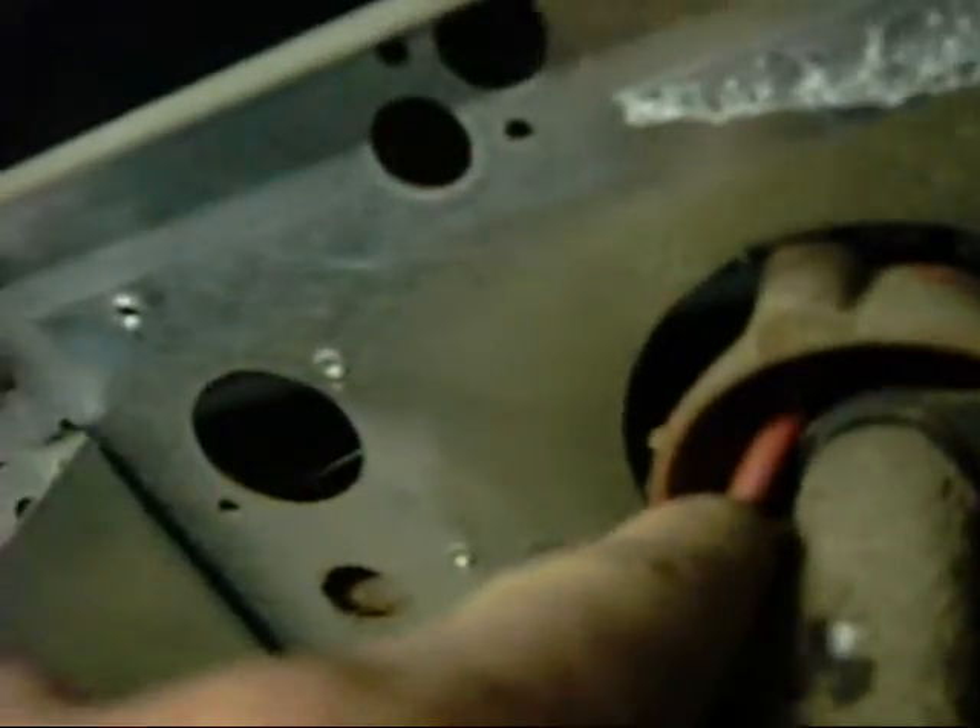I've got a clean in here next and that'll be it — give the transformer a bit of a clean up, wipe out, get the chassis back in and clean the case out. Well, this is the inside of the high voltage section and the flyback transformer insulation is just gone — not happy. There's a big tube in here. There's a fine winding on here plus the coarse primary winding. There's a secondary going out to the HT lead. There's also these two here — just a single loop around, probably the frequency controls. And take that off. It's a bit rough but it'll work again.